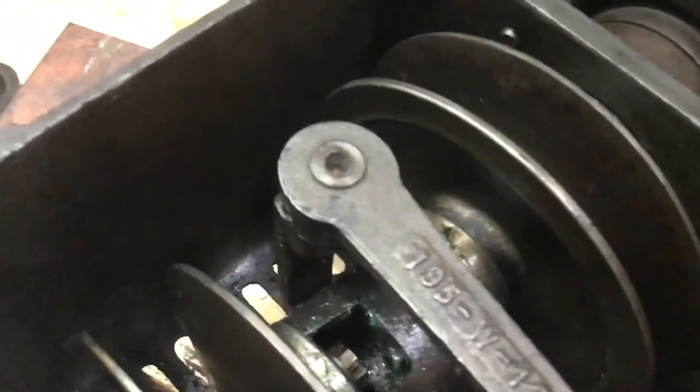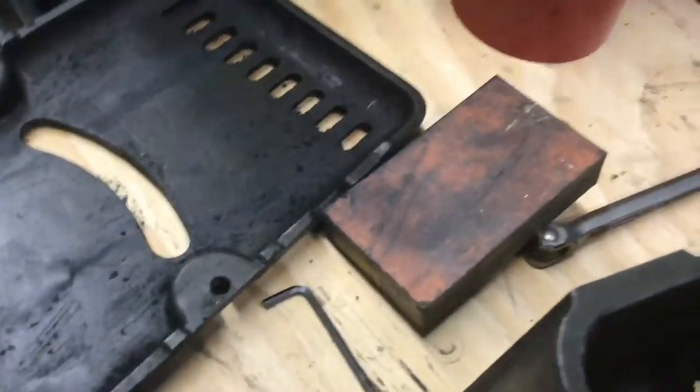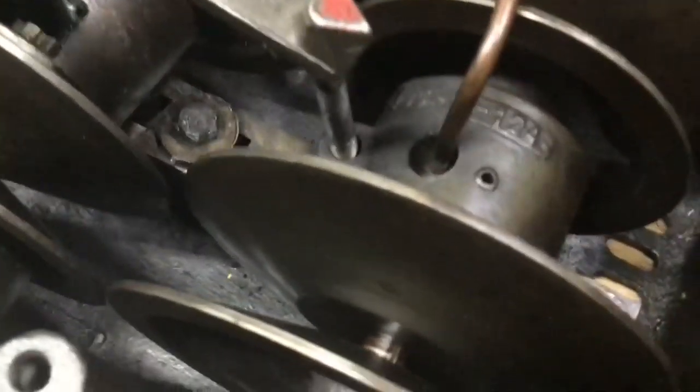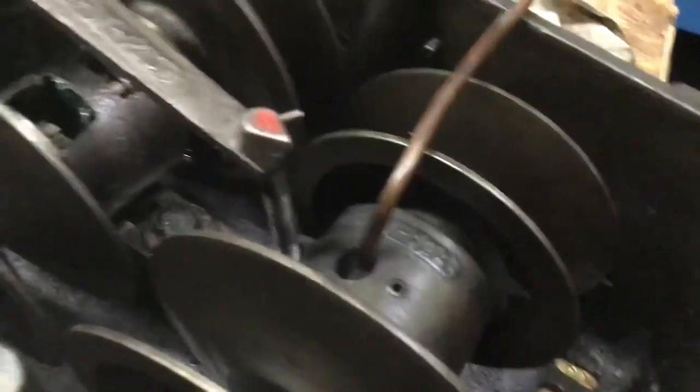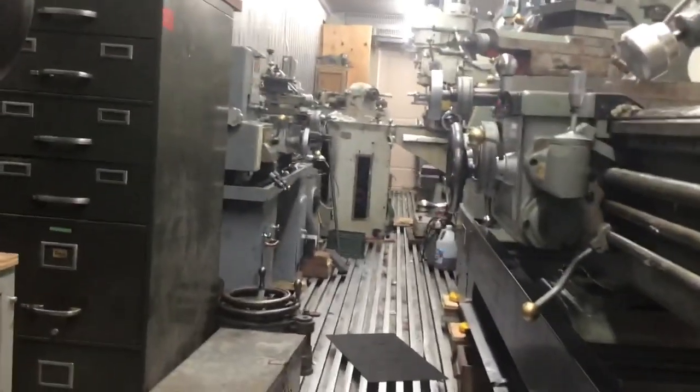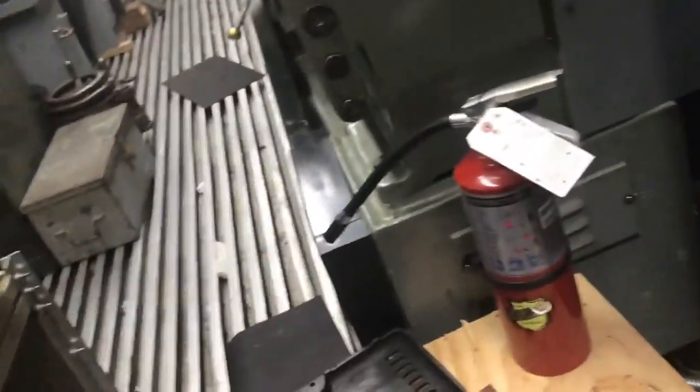As well as underneath, as long as it's tapered. The fun part about all this is I've got to take this apart again to put belts on, whereas the link belts I can probably do as it sits like this, then eventually put it together and stick it back in that Elgin lathe back there. The other belts I tossed already — they were reinforced belts in rubber. I actually used string around them to reinforce them, interestingly. They were good belts; I just don't know where to get those things made anymore.